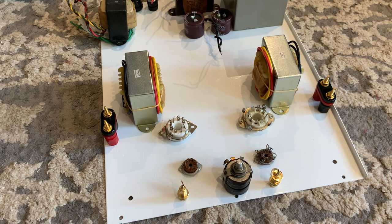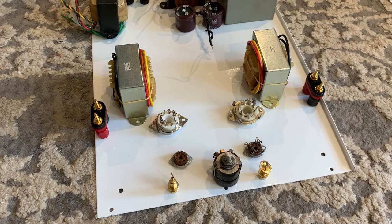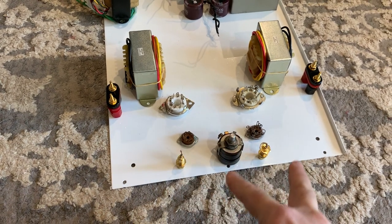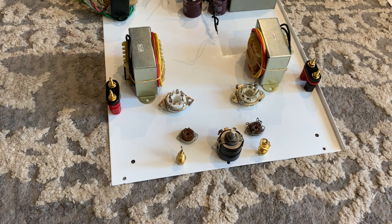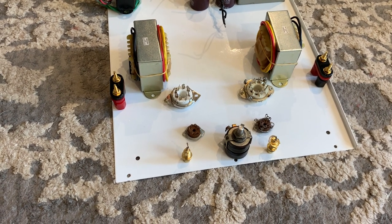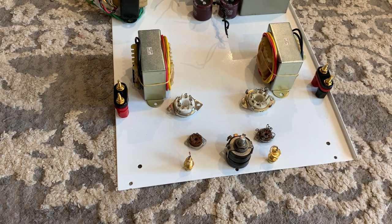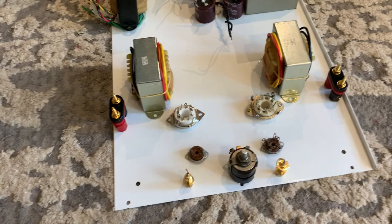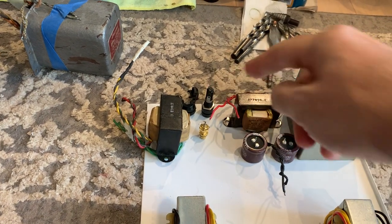So how does the layout work? You really have to arrange the parts going with the flow of the signal. The very front of the amplifier is the input — so our RCA jacks are right here in the front. I know some of you will be booing that: 'I don't want to see any of my cables, I want convenience, my wife doesn't want to see those cables in the front.' And then what a lot of designers do — they give in to temptation and put the RCA jacks in the back.